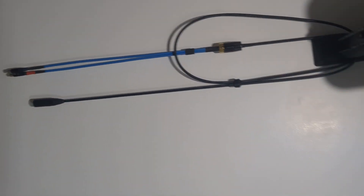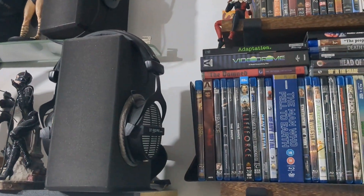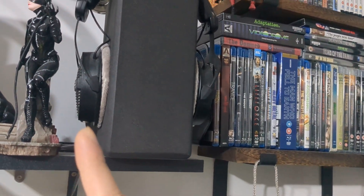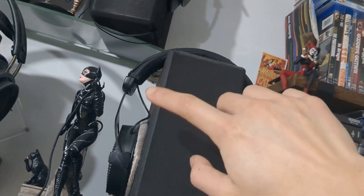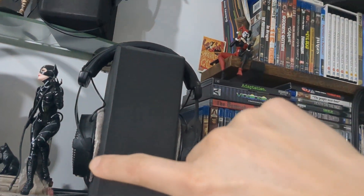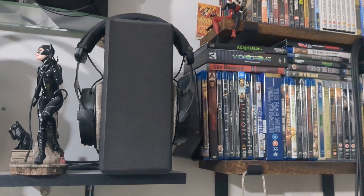I'm going to focus on a couple of things — one being this custom cable and my DT 990 Pros. Originally when you get the DT 990 Pros, you get a permanently attached cable coming off the left earcup, and it's wired as single-ended. There's a wire coming out of the left earcup which runs through the headband and into the right earcup, with solder pads on the left driver that continue the signal to both earcups via that one entry point.